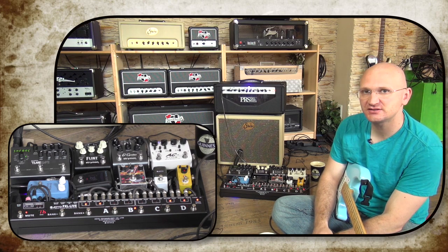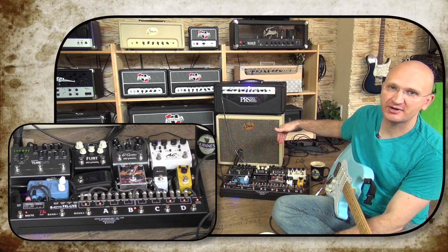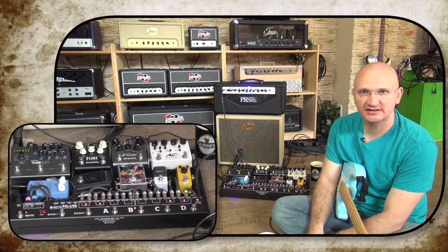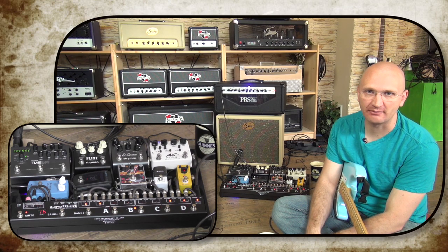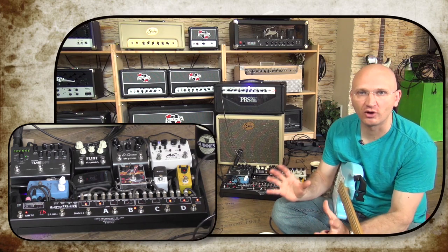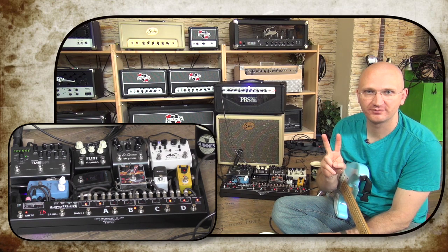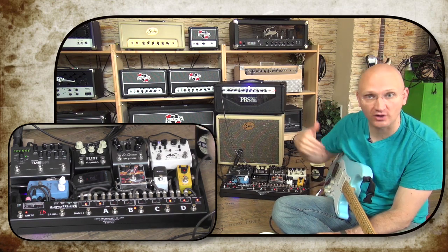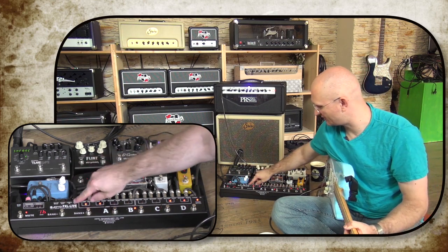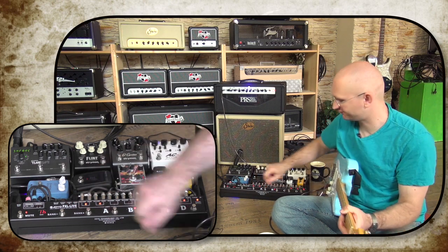The PXL8 is an 8-loop switcher. 8 pedals going from right to left through that, and they will all be in front of your amp. Or they could all be, of course, in the effects loop, but it is all one block. Now with the Pro and the Live, you have 2 blocks of 4, which you don't have to use. You could still use it as one 8-channel looper, in which case you just don't plug anything into the loop in 2 and the loop out 2, okay?